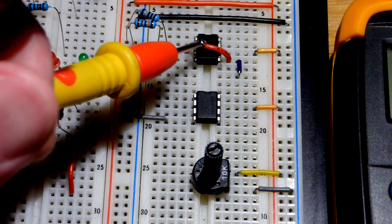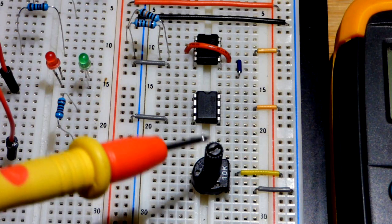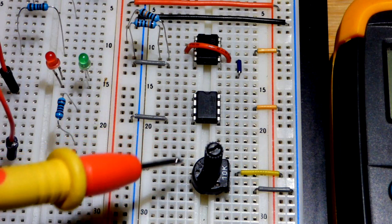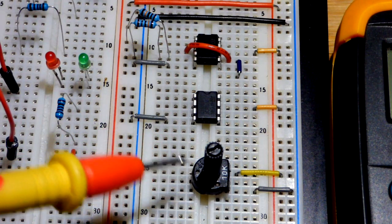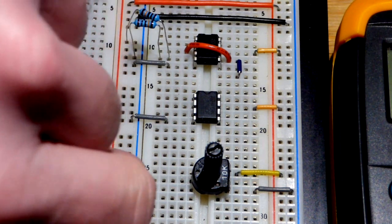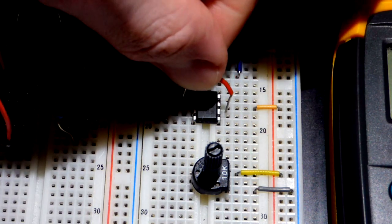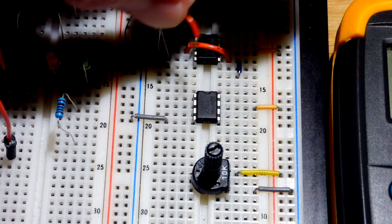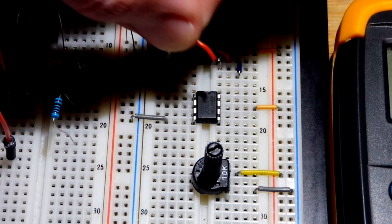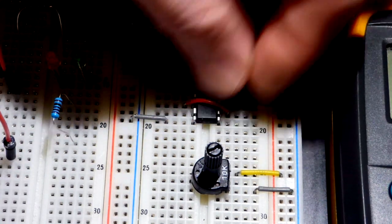And we're going to basically make this circuit, but the voltage divider is going to be set by this trim pot, and so it can go anywhere from positive 9 volts now to negative 9 volts. Halfway is 0 volts, of course. And so all we have to do, same as this one up here, we take the output, third pin down on the right, pin number 6, and wire it directly to the inverting input. So that's pin number 2, second pin down on the left. And we have that there.